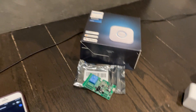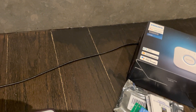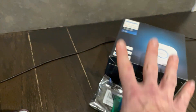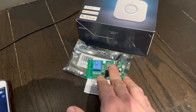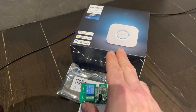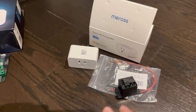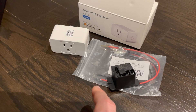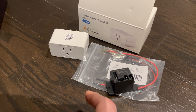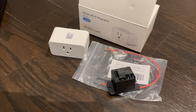Now I've wired in a separate solution — you would not typically have two smart switches relayed into the same fireplace, but for the sake of this demonstration I've done that. So a completely separate solution that would not require any of these components is a HomeKit solution. Different from the Zigbee smart relay, which requires a Zigbee hub for control, Apple HomeKit can be controlled directly from iOS or macOS devices. However, if you want to control those devices when you're not home or run automations, you would require a HomeKit hub. Various devices are supported as HomeKit hubs: Apple TV, iPads, HomePods.